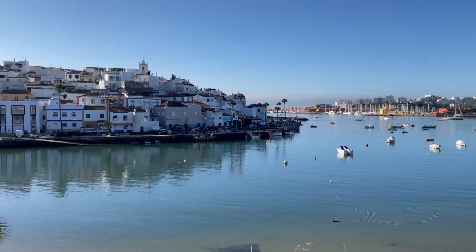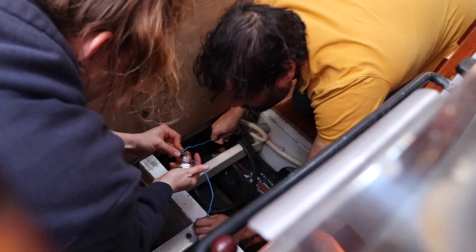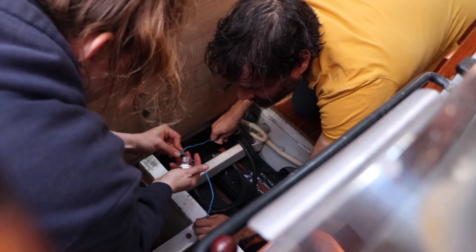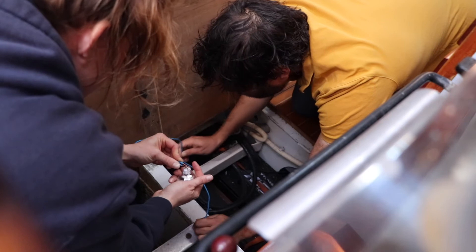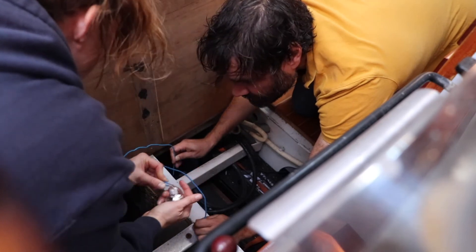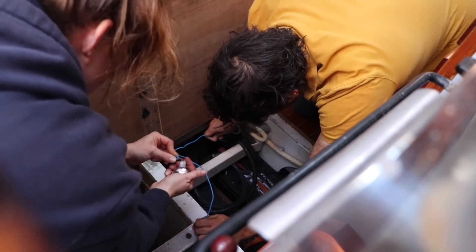To isolate the issue, I switched off all electronic systems — the pumps, toilet pumps, winch, chain, bow thrusters, everything. But we still could light the light bulb with the connection between the hull and the battery plus, which was kind of weird.